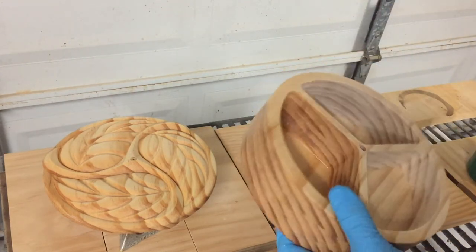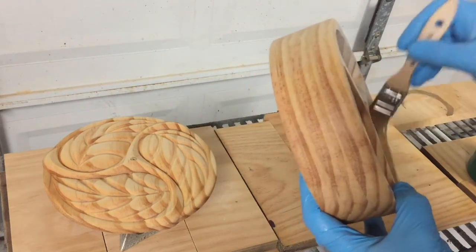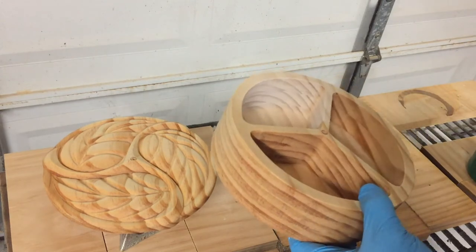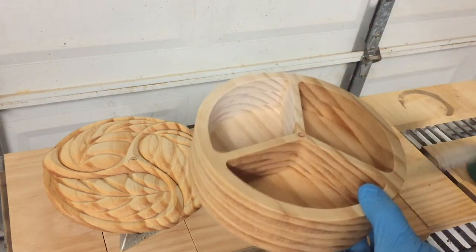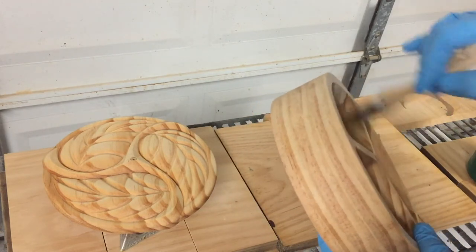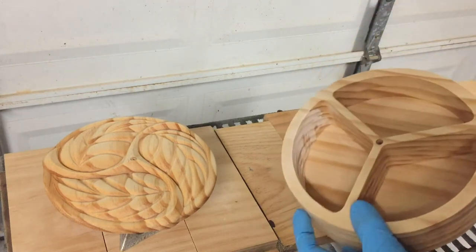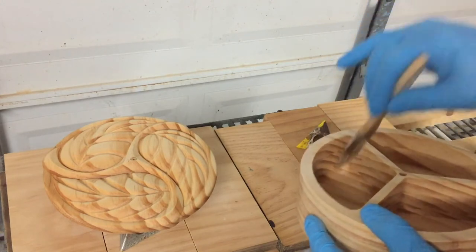Now, this particular species of pine is from New Zealand. It's sold at the big box stores as select pine, but it's actually radiata pine, and it has a hardness level equal to or greater than the hardwood poplar that you may be familiar with. The big box stores sell that too. So I like to use this wood because it's readily available and easy to work, and it's a little bit harder than your standard pine boards, like number 2 boards that you find at the big box stores. Plus, this has a benefit of being kiln dried, so it's a better quality. Very seldom will you find any knots, so it's a clear pine. Very easy to work with